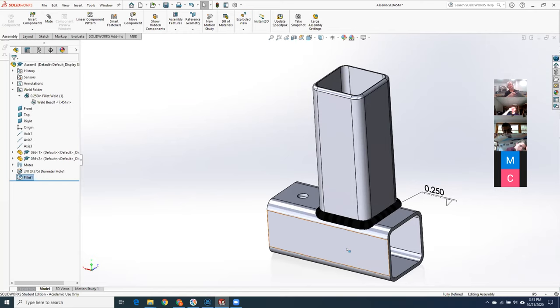Even this airfoil, you would think as critical as this thing is, that it would require grinding of the welds. Well, there are some air passageways, which I don't know if you can see. There are little bitty plugs on the end of those that are welded in place. And those weren't ground flush. We just left those.